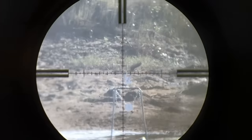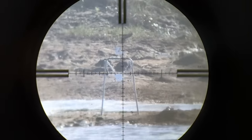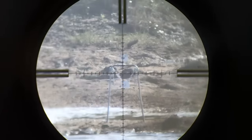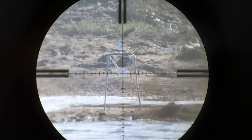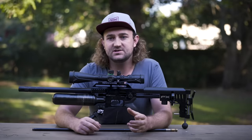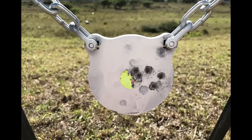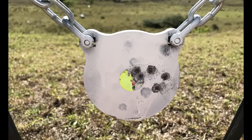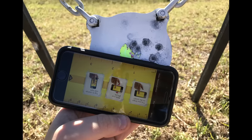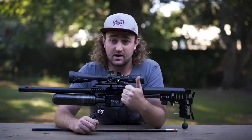The barrel was a big improvement from the original pellet barrel, but the shortfalls were these. With the first prototype of the slug liner that we made, we found that it would shoot a really tight group and then it would throw one off. There'd be flyers where you'd find a bit of a wobble. It turns out that this was something to do with the choke. The choke diameter was fine, but the choking method was incorrect, and was causing issues. There was some fouling that was causing the odd slug to be thrown off. Actually, this was a design flaw first and foremost.